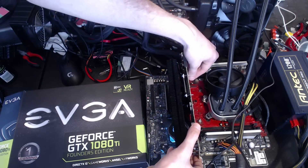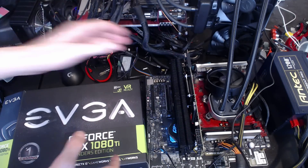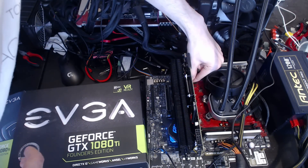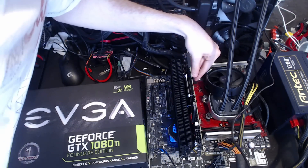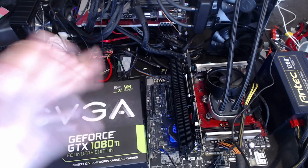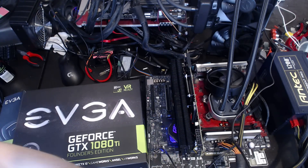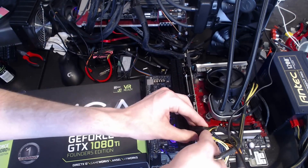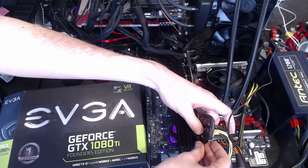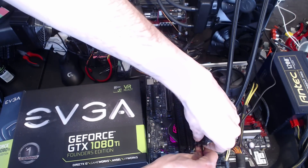As of right now, if the card is working the way I think it's working, it should not be a fully functional 1080 Ti, because the missing shunt resistor and the rewired 12 volts power plane means the card will probably go into safety mode and shouldn't actually be operational. I don't actually know what happens when that presence pin isn't connected — I've not tried it. All of the reading I've done says it's necessary but doesn't say what the failure mode is, so I really don't want to find out if it's something really bad. Just in case, I do plug that in always. It might not even be necessary, but I'm not interested in finding out that it kills the card if the pin isn't plugged in.